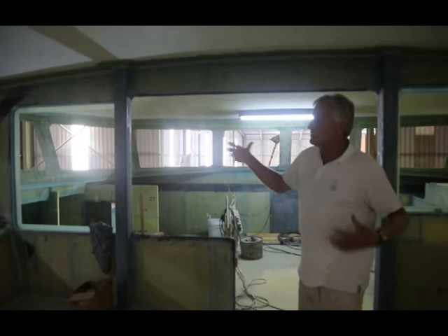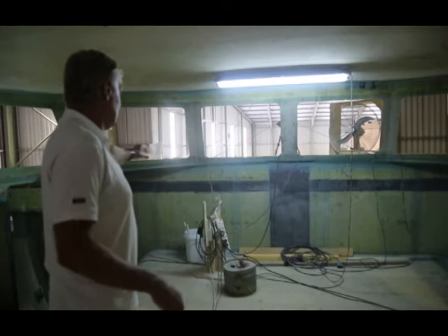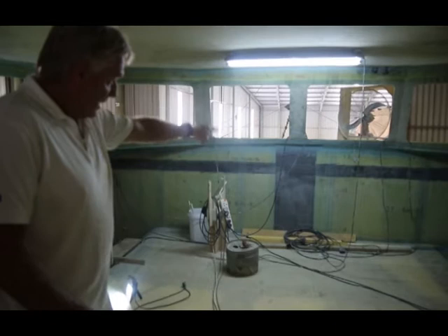As we go further in the boat, you'll see the front member where the mast sits on — it has a huge carbon band running right through it from corner to corner. There are about 14 layers of carbon running across there, recessed into the foam so it's not sticking out. And then where the mast sits, you have another carbon pillar going down.